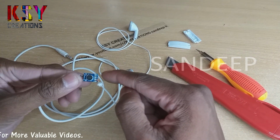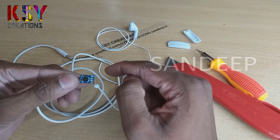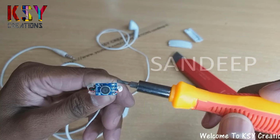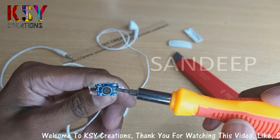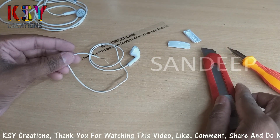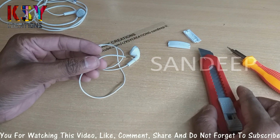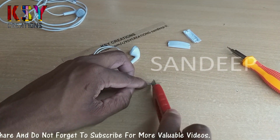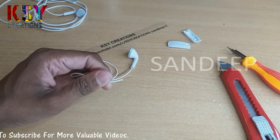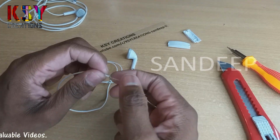So here are the terminals where we should solder the earphone. Here is the positive, this is the positive, and beside that it is the negative. To solder this earphone to the circuit board, you have to cut the edges of the wire. Here we can see two terminals.